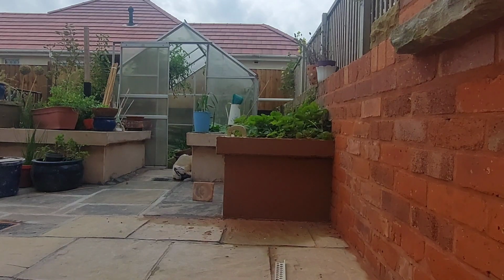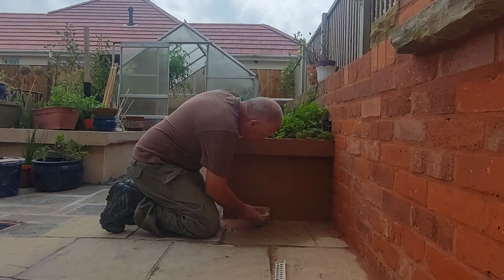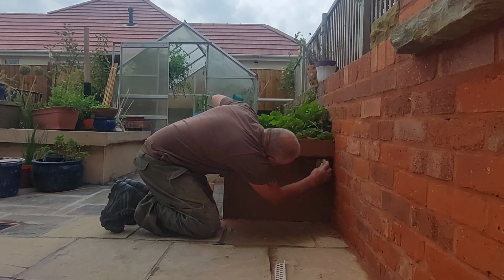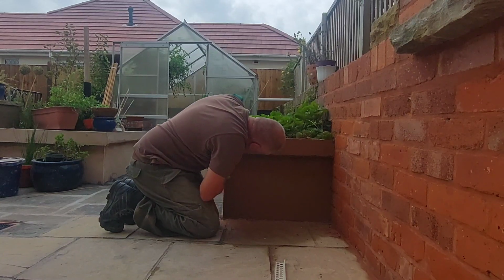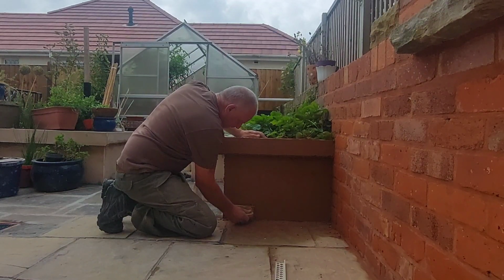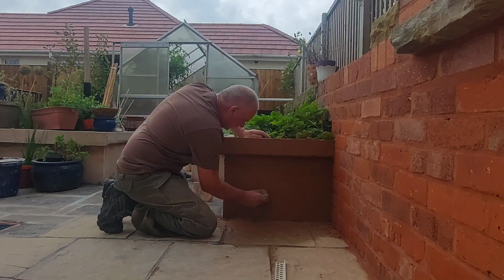Right, well, we've got to that point now where we can start straightening up and things. Using the little float, I think, on this bit. Fill that top edge there where it's not got any in it. Of course, when you go into your bead edge, you push it to the very edge of that bead, so that from the other side of the angle, it's not sort of sticking out. You know, it needs to be flush with the edge of the bead.